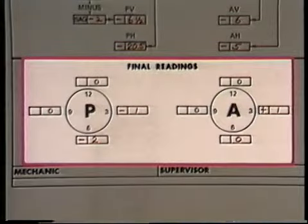Once all of the support bolts have been properly tightened, the shafts of both components should be aligned properly. However, the mechanic will take another set of dial indicator readings to verify that the alignment is within tolerances specified for the equipment. Data sheets usually have a place for the final set of readings to be recorded. According to these final readings, the alignment is within specs, so the equipment can be returned to service. It's important to note that because of thermal growth and other factors, the final set of readings won't necessarily be zero, but they should indicate that the alignment is within the specified tolerance.